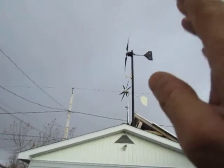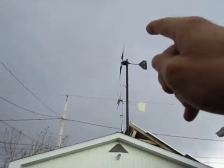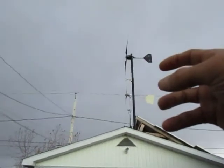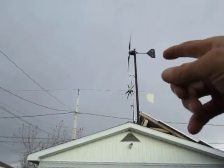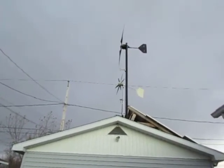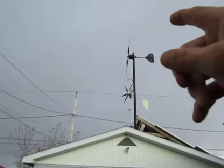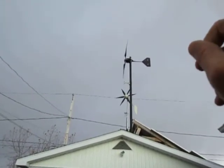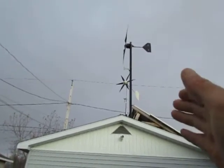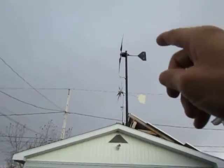And around 6-7 miles an hour, it depends on the direction. And don't mind you that thing, I built my head, my frame, to go on the same pole as the previous turbine bracket, so I can save in building a different pole. And I omitted to calculate the weight of that turbine, and it's not free tracking. It takes around 10 miles an hour to push the turbine in the same direction as the wind to track good. So that's one flaw that I got on that turbine.